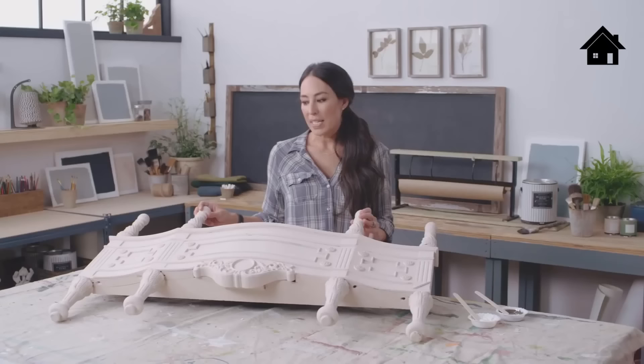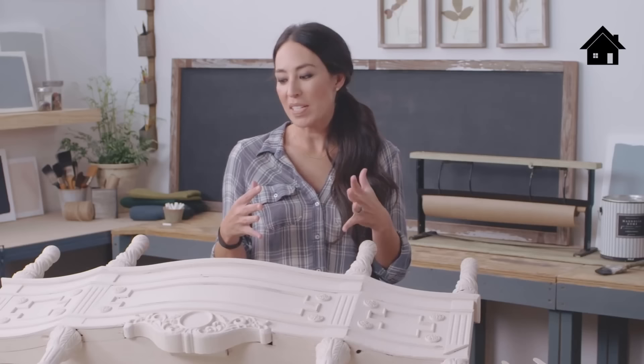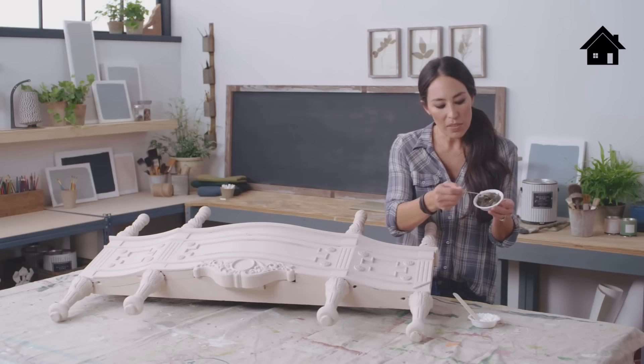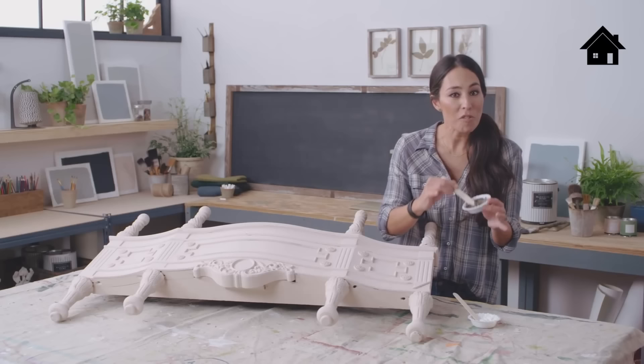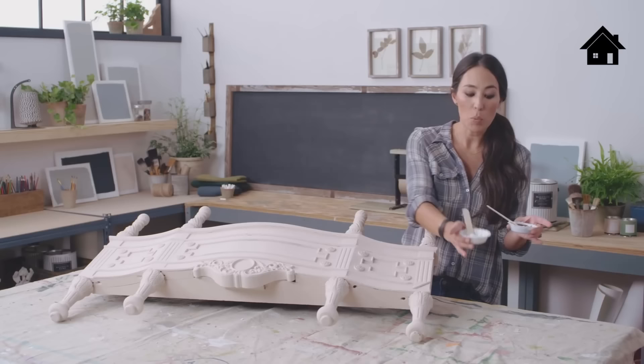This is the footboard — already painted with Ella Rose Pink, two coats, dry and ready to go. I love showing several different ways to finish a piece because it highlights the best features of the furniture. The first look uses darker wax — smooth, easy to work with, low VOC and low odor. You can mix dark and clear wax for a lighter look, or apply several coats of dark wax to go darker.